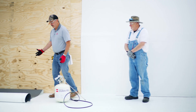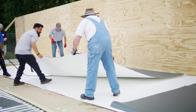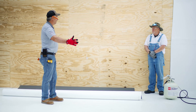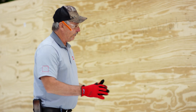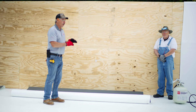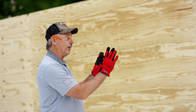On this setup, that's kind of what we're going to do here. We've already got it welded down, we're six inches on the flat. We got our base attachment and we're going to run this up in one shot. It takes a few people to do this, especially with a longer sheet. We've got a 10-foot wide sheet here, so we may enlist a couple of guys. We've got to glue this up and get it up the wall with no wrinkles — we want it tight at the angle change, no bridging.